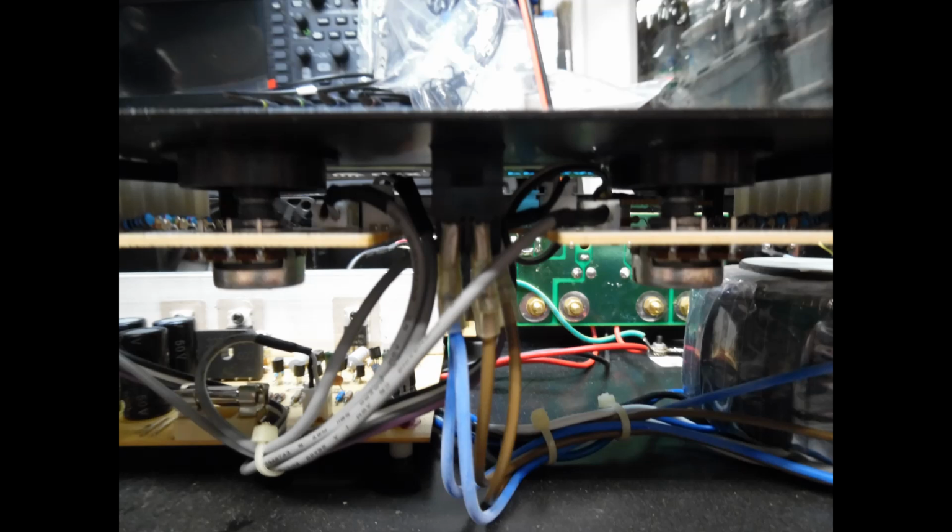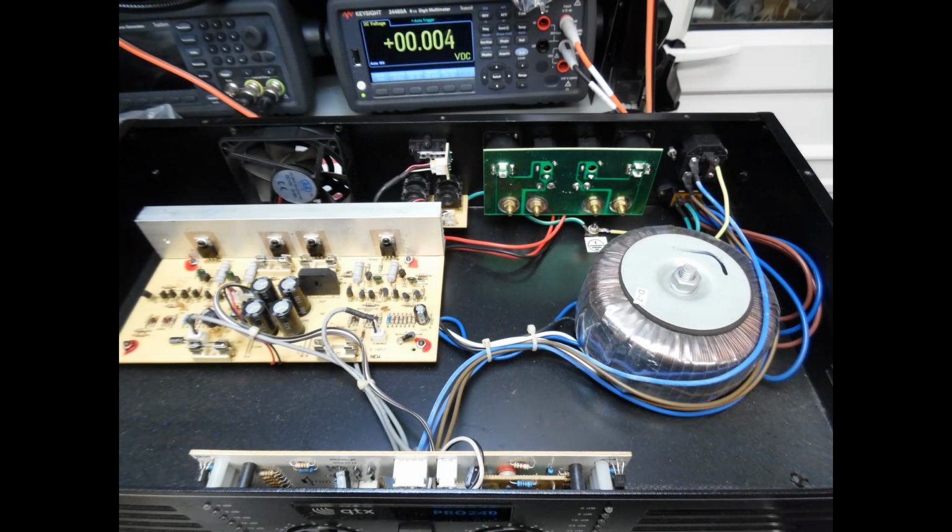You shouldn't hear any loss of sound as you make the adjustment, or any popping or crackling, which normally tells you that you have issues with dirt or maybe contamination on the carbon tracks. And then once that was done, of course, power up the amplifier initially under the dim bulb, and then no issue. And then after that, power up the amplifier under full mains power. And there's no adjustment to make on the amplifier board. It's already set via the resistors and the circuit.